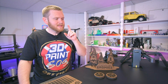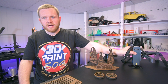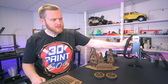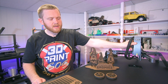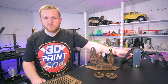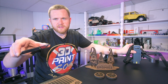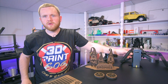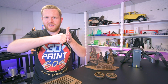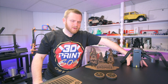The second thing is the same exact problem as the X7, and that's this knob. The knob that you use to set the height for the actual laser itself, all it is a bolt that goes all the way straight through, and that bolt just pushes up against the piece of aluminum. That's how it holds this entire assembly upward. I think it cheapens the entire thing because it's not very precise. Not that it needs to be, but for example, if I put this little piece to align everything down like that, you go ahead and tighten it, and now I can't pull this piece out, because when you tighten this bolt, it just goes into the aluminum and it kind of tweaks itself a little bit, and it doesn't sit perfectly flat. That kind of thing, that's my only gripe.